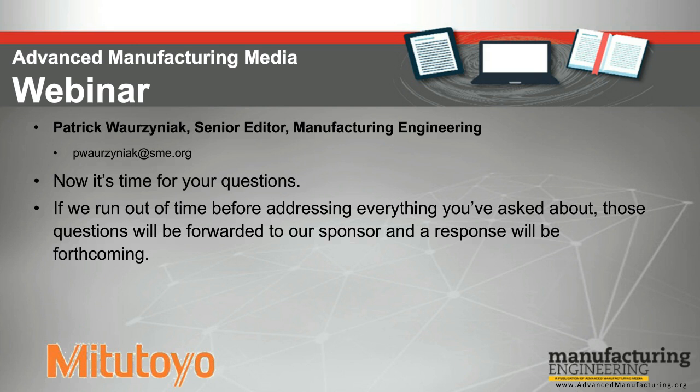I see you can measure the surface with the sensors you mentioned. Can these sensors measure features below the surface, Alan? Yeah, so you're going to have different types of parts you're going to measure. If you had a through hole, we could avoid the through hole. If you had a blind hole, let's say, you should be able to measure the depth of the hole. Some of these sensors won't be able to measure all the way down into the blind hole, depending on how deep the hole is. But yes, you can measure below the surface.